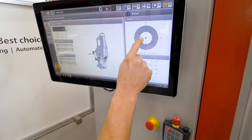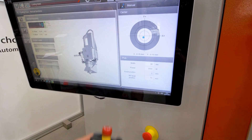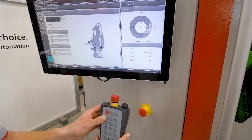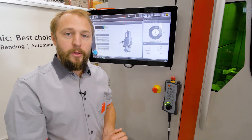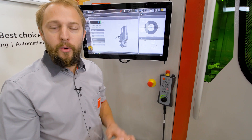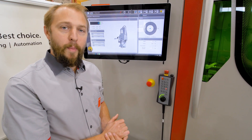Here on the screen I can move manually with my handheld to the spot where I saw my dot. I will repeat this step until the nozzle centering is perfect. Then we will confirm it and save that position on the cutting head, so in case of a collision the machine will automatically go back to that position.